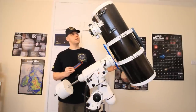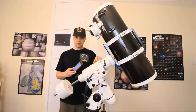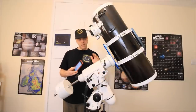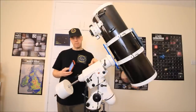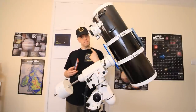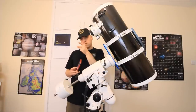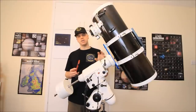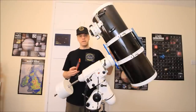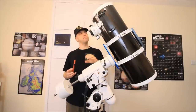What we're going to do is take a closer look at the drive axis and see how responsive it is. Don't forget, with the gear type that I had, there was a lot of play. So we're going to test how it moves in between. Now, usually gears suffer from backlash, so the whole idea with this belt modification is to eliminate this backlash problem.